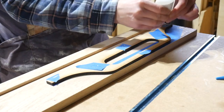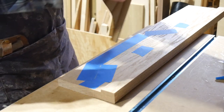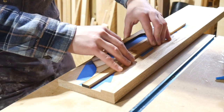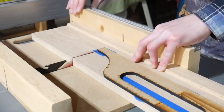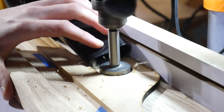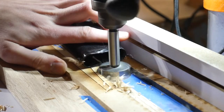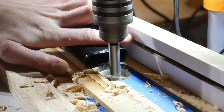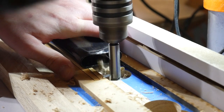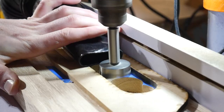I also have a laser-cut template for the main handle piece. So I'm using some painter's tape and then CA glue to just put this onto a thinner piece of red oak that I had. I bring this over to the table saw and cut it to the proper width. And then I start hogging out material where the hand insert is going to be, using a Forstner bit that's approximately 1/16 inch smaller in diameter than the slot I'm going to be cutting.